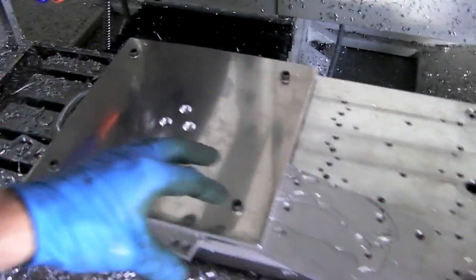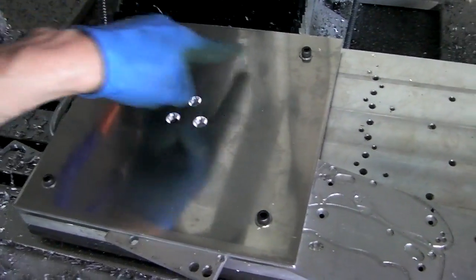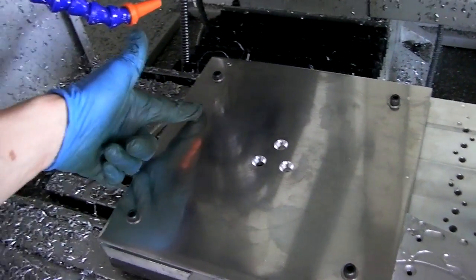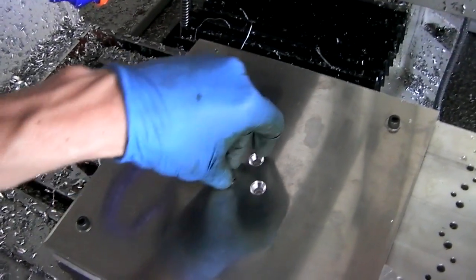So I was lucky enough, this is my Norseman handles fixture. I was lucky enough that I could make 4 bolt holes line up around the outside of the circle so that I can cut it out. And you can see I got those drilled. I got these drilled and countersunk. I'm going to use these guys. They go in there nicely.